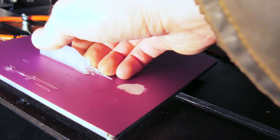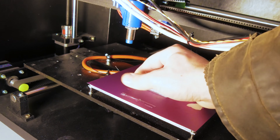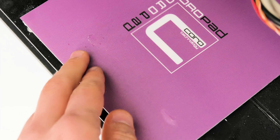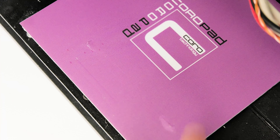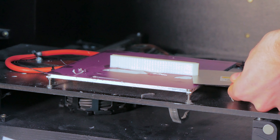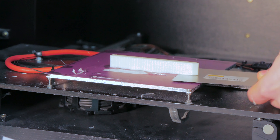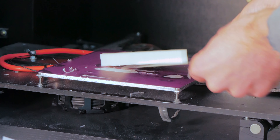So maybe reduce the heated bed temperature even more if you're planning on using it, or just use it cold. The Coropad in general also isn't the most robust surface, as it easily gets kinks and tears from removing stuck prints, especially since the adhesive on its back isn't particularly strong, probably to make replacing it easier. But then again, it is the surface that I got absolutely the most adhesion out of in the widest range of situations.